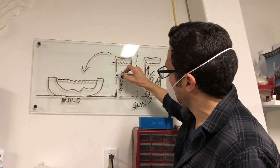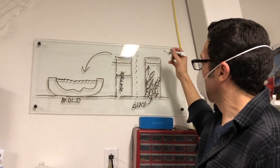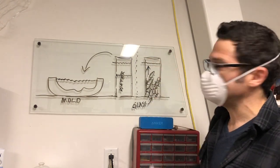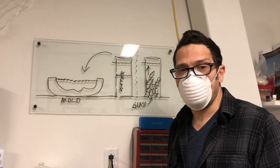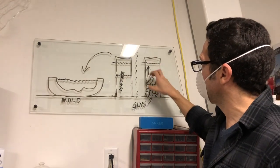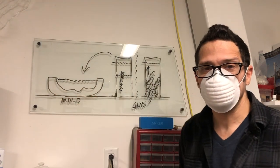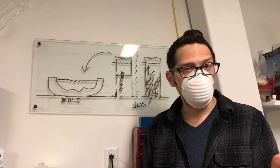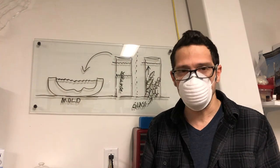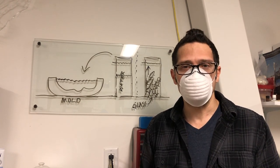I'll have a mark inside my mold where I want the glass to come to, but I don't necessarily want the glass to go all the way to the top. I pour my water in there, and of course that's going to mean the water level drops. Now I've got all that empty space but I have my mark. Then I'm going to take chunks of glass and dump them in there until that water level rises back up to the same mark. Now I know that's the amount of glass I need — that much glass is taking up that much space. That's displacement.